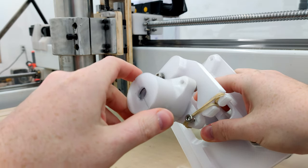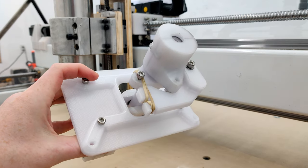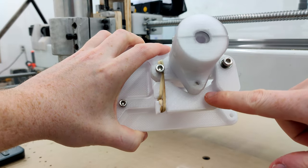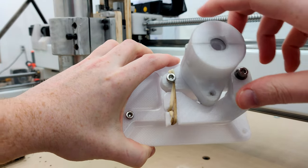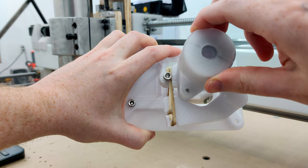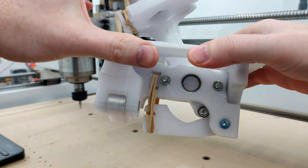The major problem I've run into with 3D printed material is that it all shrinks and changes shape no matter what. In the design — for instance I'm using SolidWorks — I've profiled this cam shape perfectly, but because when it's 3D printed it deforms, a lot of times you get problems like this. I'm not sure exactly what part of the curve is changing, but it tends to happen on every single angle.